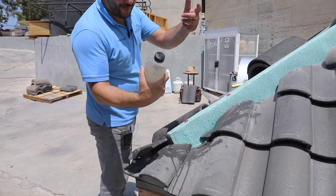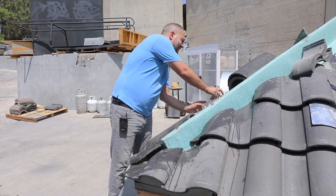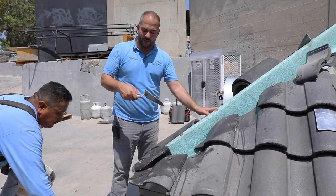What we're using is a real simple tool — it's a water bottle with a hole on top. Nothing fancy. You want to do that throughout the day as you're mortaring; it's not something you do just once.